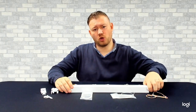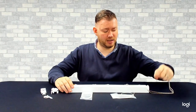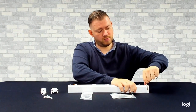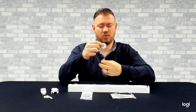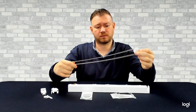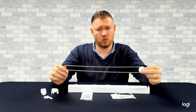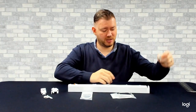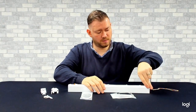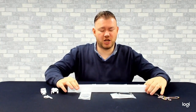It comes with a 1x1 fast lift which will pull 3.5kg or a 1x4 heavy lift which will pull 10kg. Both these options have our child safety independently tested breakaway cog. This pulls out of the head rail at 6kg and because it breaks away you do not need to attach your chain to the wall, and it can also be 60cm from the ground. If it does come out, it's very easy to re-insert so there are no callbacks to re-attach your chain.